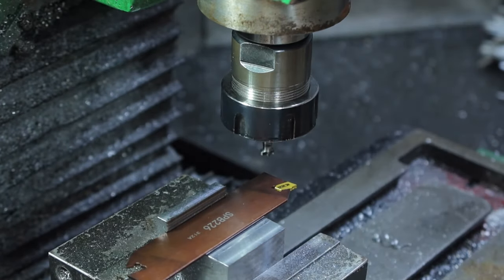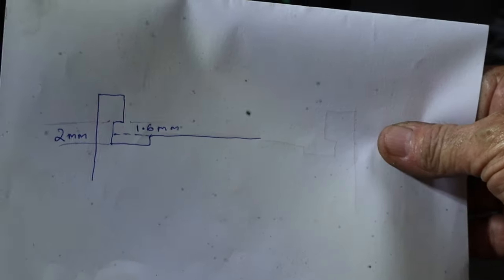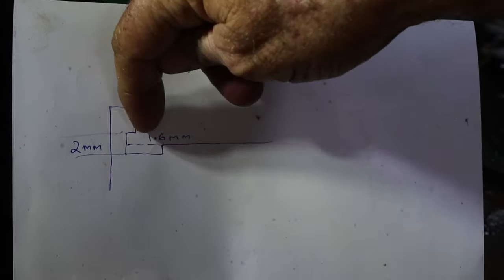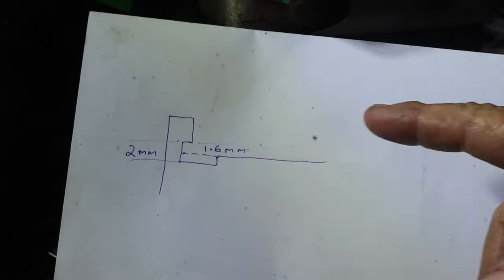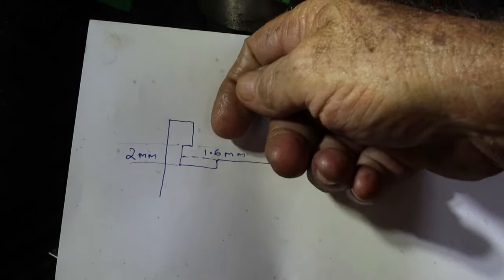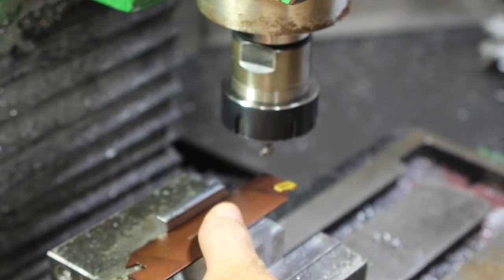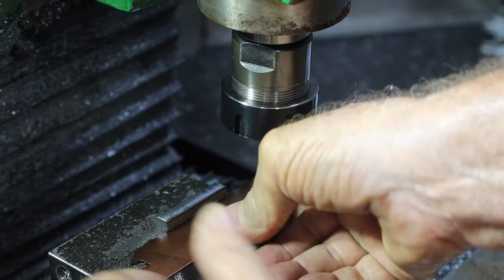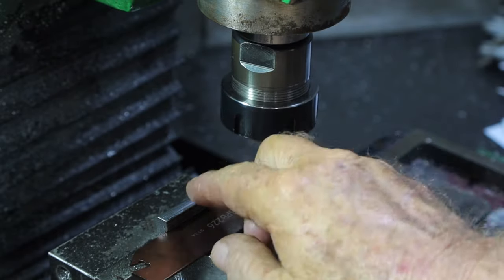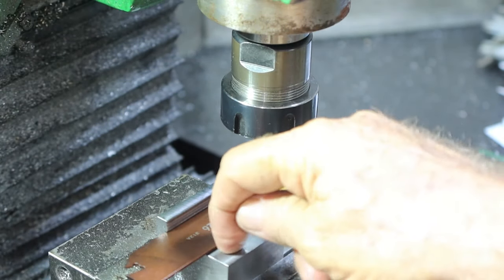After a nice juicy Australian sirloin steak lunch I concocted a plan. What I did was run a six millimeter end mill down through here 0.35 deep, then touched off this little cutter and moved it in 1.8 millimeters and down 0.4 millimeters. What I effectively cut in there was a 1.6 millimeter slot, and as you can see that fits in there quite nicely. It won't slide all the way in, but if you push it down it'll pinch in there - which is probably perfect and gets me what I want. Now I need to knock a bit off the top and then come back and mill this down about 12 millimeters or so.